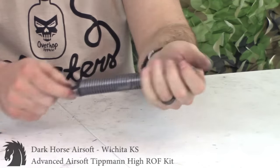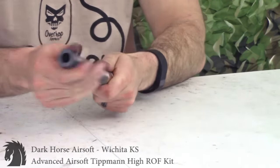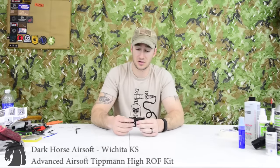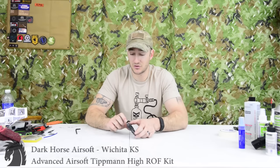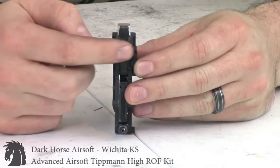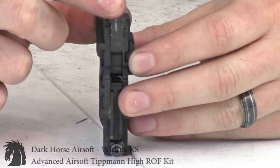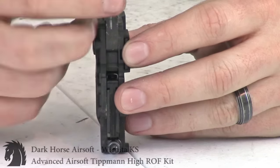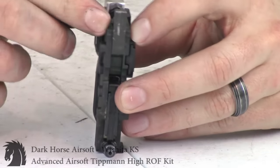If you need to, put something on the back of the device — grip pliers, whatever. Now I'm going to grab the trigger box. The instructions say if there is any resistance between the sear and the trigger box — as you can see mine has a little gap between either side of the sear in the trigger box — if you listen carefully there's no rubbing. If there is, you're supposed to shave it down so it can kick back as fast as possible. If it's binding on the side of the trigger box it's obviously going to slow it down.